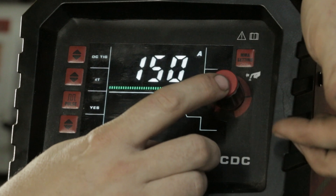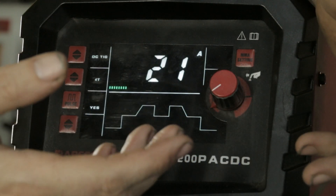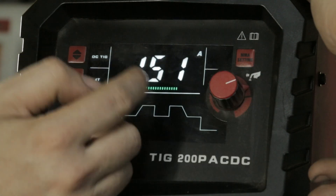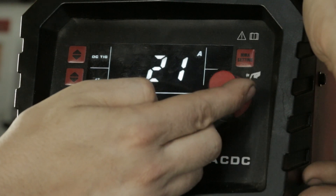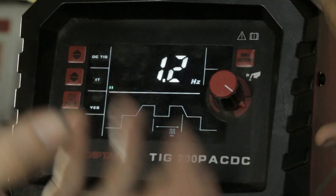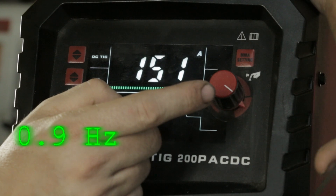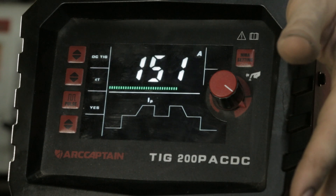How we do that: press the knob and let's go through. This is our base pulse — preset at the factory, you basically don't have to worry about it; it automatically goes up and down depending on what you're doing. This is the peak of the pulse — the power side. This is the rest side. The next is we have our hertz. The easiest way to describe hertz is the speed of the pulse — the higher the number, the quicker the pulse. For the most part, between 0.9 and 1.2 is a good range.